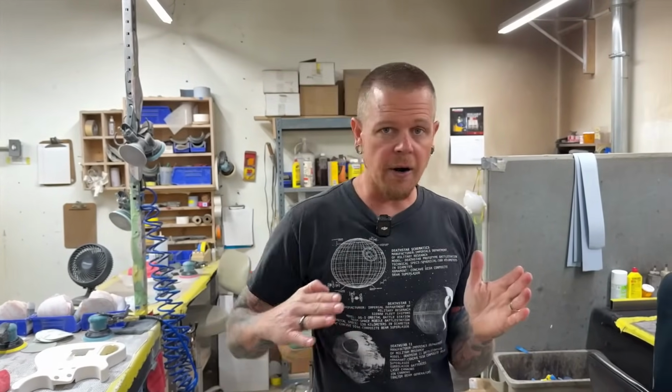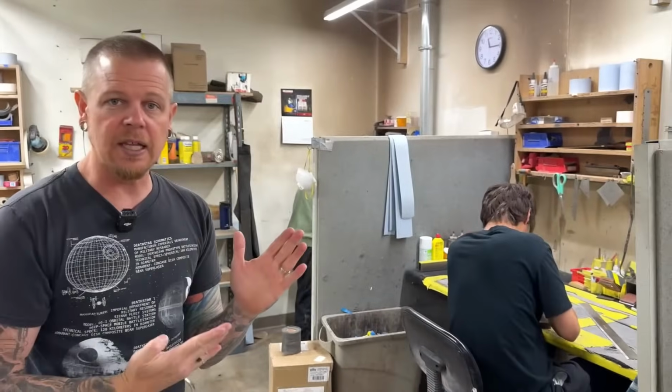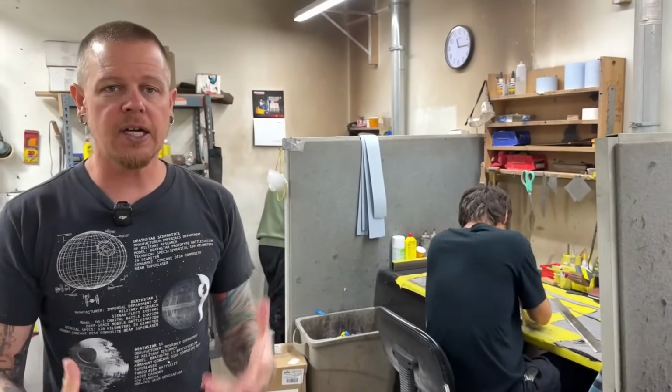So what we do is we get our necks perfect. We get the fretboards perfect, the radius perfect, press the frets in one at a time. Make sure before we do the fret work, everything's lined up. We don't have any high frets, and then we do the fret work. It's the attention to detail, the meticulousness.